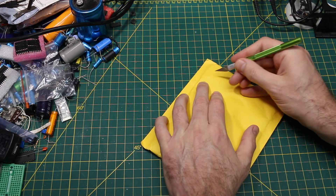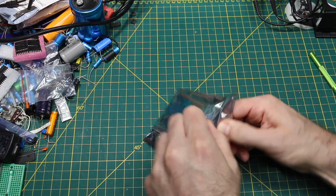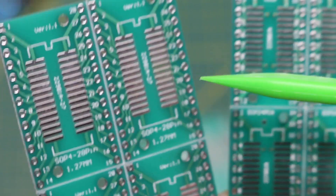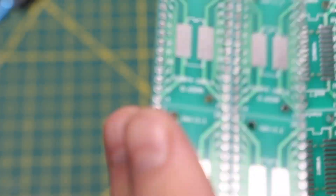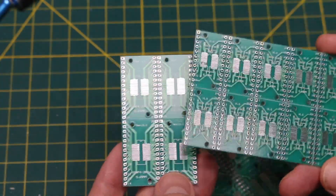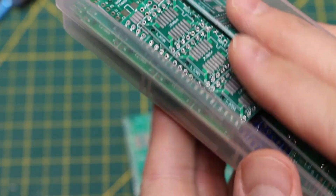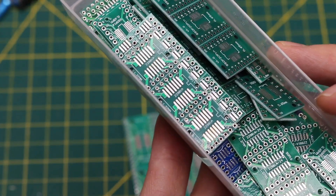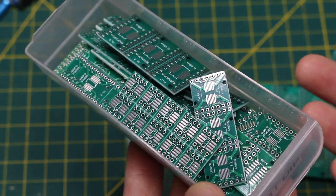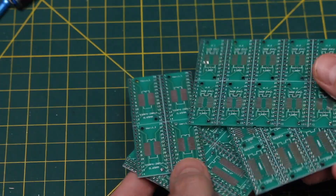The first one I ordered maybe three weeks ago. I don't know why they put circuit boards in anti-static bags, but it's even resealable so I'll keep that for other purposes. These are 24 and 28 pin surface mount chip-to-DIP adapter packages — SOIC as well as the smaller SOP. I already have a bunch of similar ones for smaller packages from years ago, all the way down to just 8-pin chips. But I recently needed to use a 24-pin tiny package and wanted to convert it to DIP but didn't have a board big enough. So going up to 28 pins will cover a lot of chips.